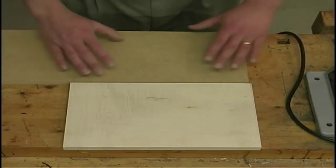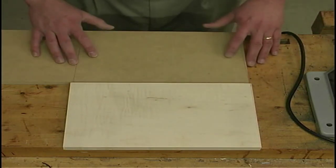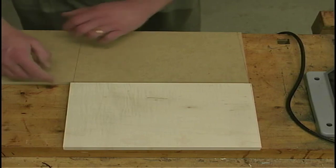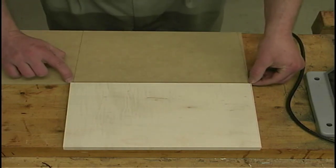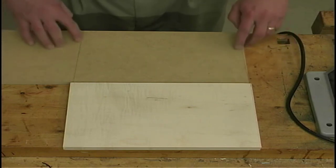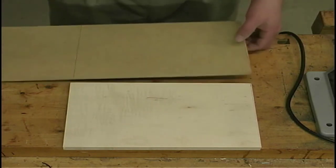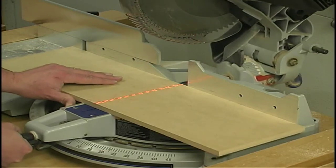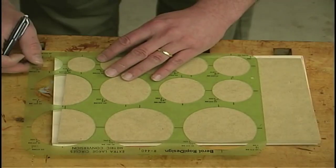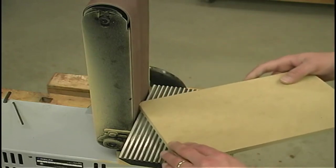Moving on to the lid now, what we need to do is make a template the same size as we want our lid, and that template will be made out of half inch MDF. Laying it out is a very easy process. Start out by ripping your MDF to the appropriate width, then make a mark setting your overall width at the wide end. Come in five-sixteenths of an inch near the narrow end from each end and draw your lines connecting the dots — it works out to about two and a half degrees. We can then go over to the compound miter saw and make that cut. Using a drafting template, I can easily pencil in the layout lines for the radius at the front corners, and a few seconds on the belt sander gives us our radius.